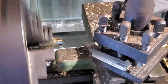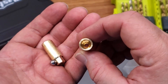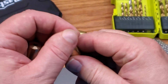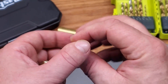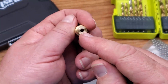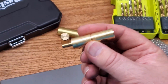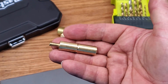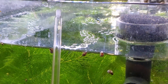I'll take that line off so I'll have nothing but full friction fit. I'm cutting it down now to the quarter, getting rid of the narrower diameter, and then I'll chamfer both sides just so it looks nicer, gets rid of the roughage on the edges, and also helps it start. Now it becomes obvious - hopefully you can see the smaller quarter-inch diameter hole inside. That is the seat for the ball bearing. It fits nicely down in there, so when air is being drawn from the bottom it seats, and when air is being pushed up it'll pop up into the three-eighths inch hole.